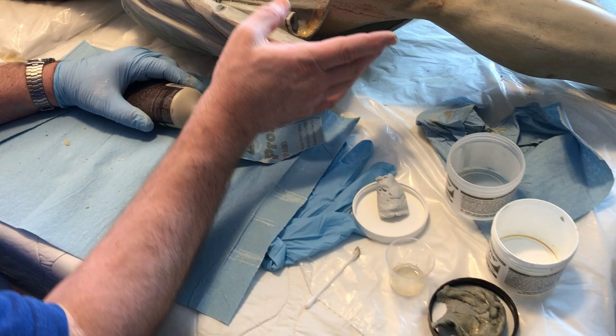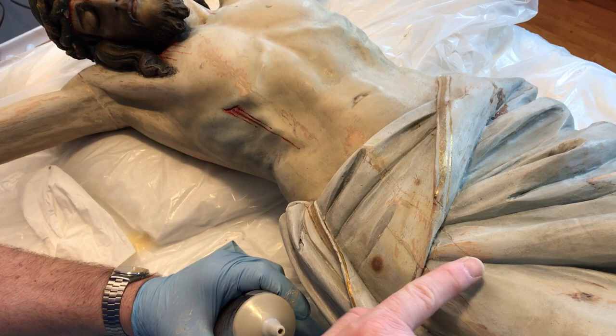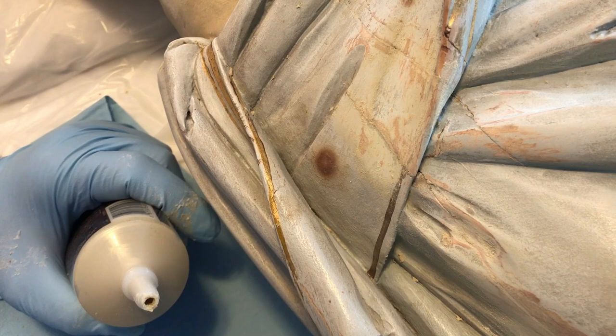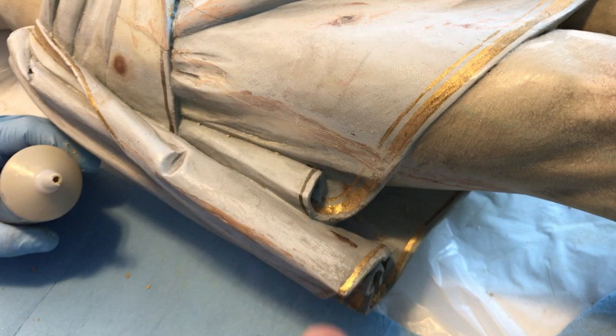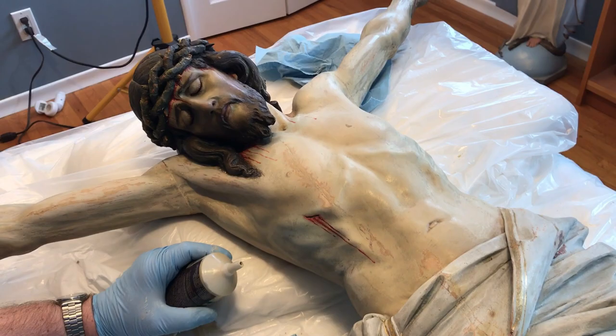You mix the two different parts and it gives you a little bit of working time, but when it finishes it becomes extremely hard, durable, and permanent. For the smaller cracks, we use a construction-grade, professional-grade bonded wood filler. It fits into the smallest of the cracks, and then using 400 sandpaper we gently take away any remaining signs of the crack until it becomes ready for the artist. As you can see from the chest area, there have been some splits — we've put on the first layer of wood filler, and the next stage will be to put on a second layer, sand it down, and have it prepared for the artist to begin her work.